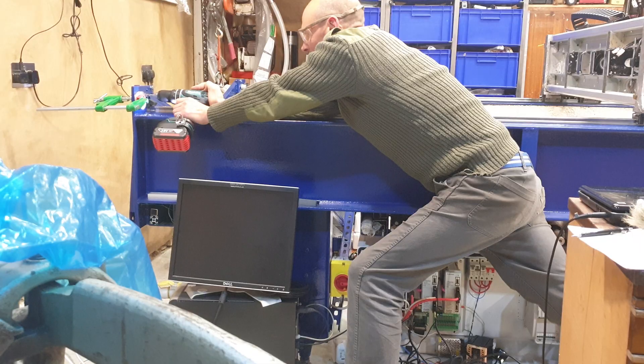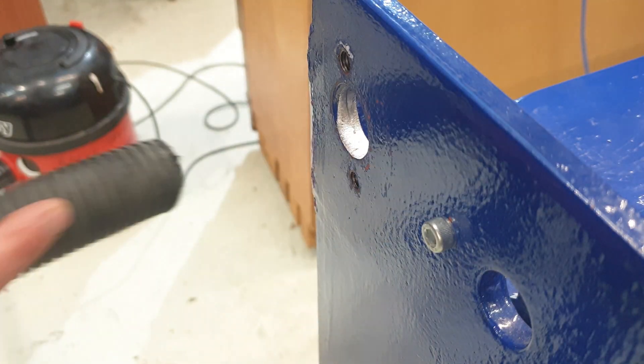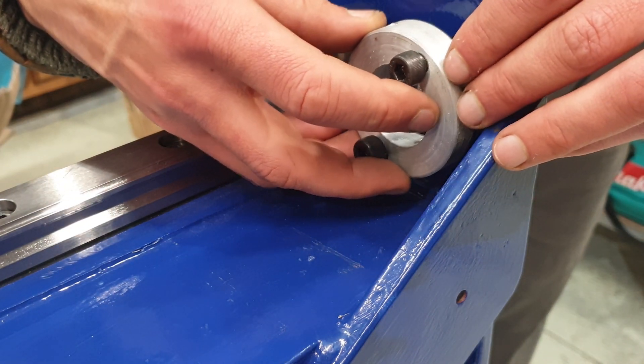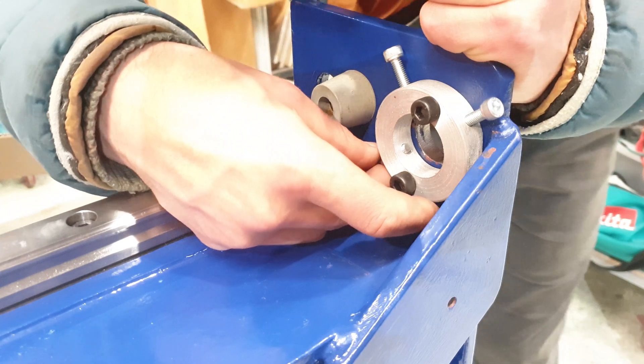I really hope I don't have to take this off. Any radial runout or wobble in that part that attaches to the nut of the ball screw would tend to force bend or whip into the screw itself, especially at high speed, and possibly even cause jamming. Despite careful dial indicating on the lathe when I was making that assembly, it still wasn't quite enough — hence this grinding operation.